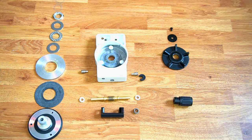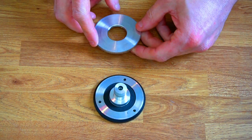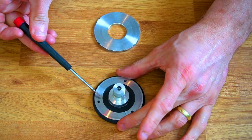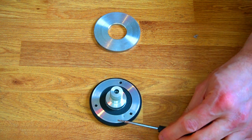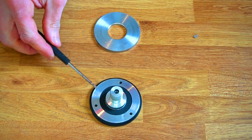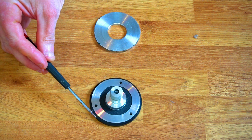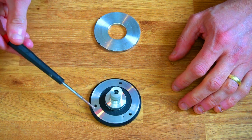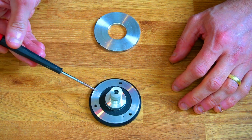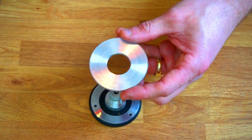So now that's the whole drive unit stripped down. Now we've got the spindle and the gear wheel. Now the point I need to make is this needs to be clean. This whole area, if it's badly damaged, you can use a very fine emery cloth to clean up this surface carefully. Only a mild amount of emery cloth, but not too much, okay? Very fine stuff. On mine it doesn't really require it because it's quite new. That's in good condition. So the thing I need to point out is this gear wheel has to be lubricated